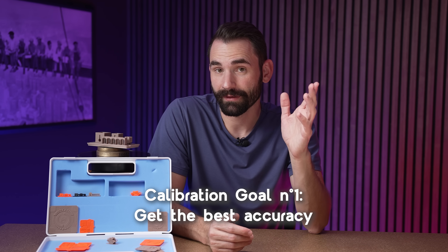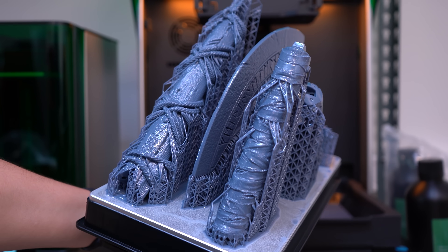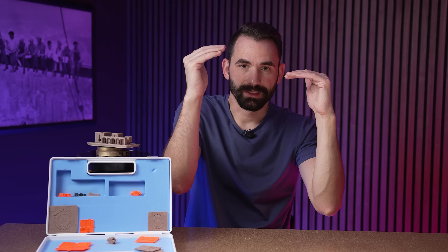At the beginning of this video, I promised to tell you how to get the hardest resin while maintaining accuracy, and this is where I'm going to do that. The first thing is we're not just simply decreasing the UV exposure time, because when you expose resin to UV radiation, two things happen. First, the resin gets hard — it turns from a liquid to a solid. The longer it's exposed, the hotter it's going to get. Hotter resin expands faster than cold resin. Also, the more energy it's exposed to, the longer the UV light is on, the more that resin is going to grow. It can grow quite large if you expose it long enough. The second thing is it physically grows and then gets harder. So what we're trying to do is balance hardness versus that out-of-control growth that happens with longer exposure time and heat.